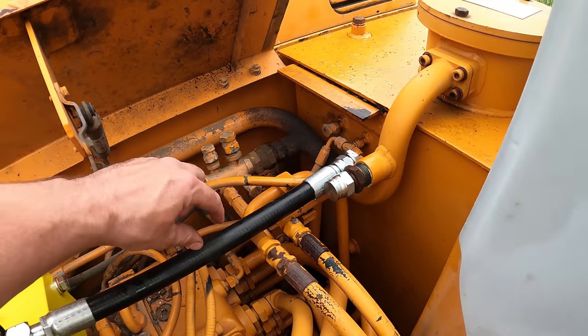So I dropped that rod off 3 weeks ago today to get fixed, and the guy at the machine shop wanted to kind of bend it back, but I told him I just want a new rod. So I told him order the material you need and just spin me up a new rod, because he said whatever direction it got bent, if you put the grease fitting on the other side of the eyelet, you can flip it around. So let's say it was bent that way, you can flip the rod around so that the bend would have been like this if you bend it back, because the side of the rod that has the bow in it is going to be the weak side because it opens up the pores on the steel.